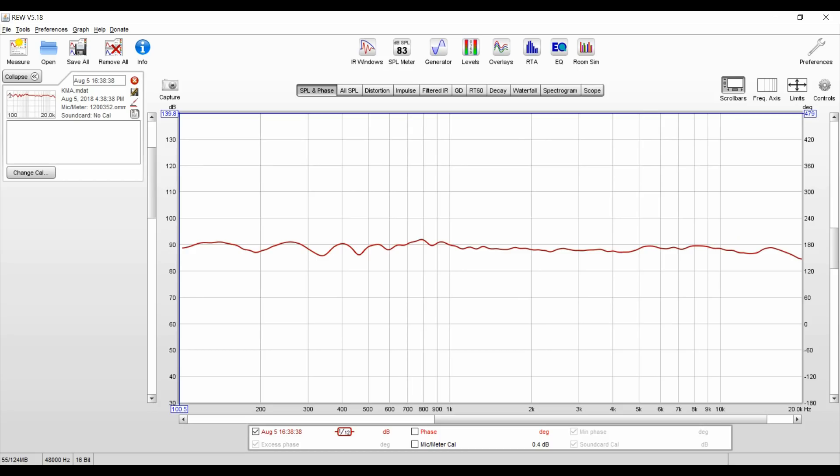So let's go ahead and take a look at the final frequency response. As you can tell, we had a very nice response at the end. We did meet our goal between 1 to 5K, bringing it down just a little. If you did want to bring this part up a little, you could by lowering the resistor. So I like it down just a little on the top end — that's completely up to you.